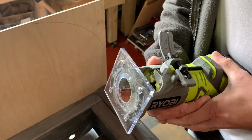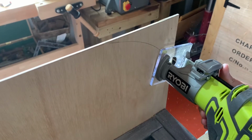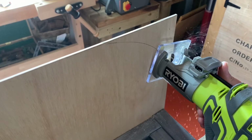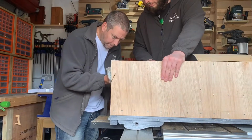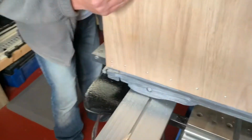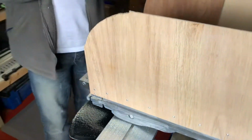So let's get this routed out. Okay, so what we've done, we've routed that out. Now, it is a wee bit rough and I've kept above the line. That will allow me to swap the battery into the Ryobi sander, non-sponsored, and we'll sand off this area and smooth it, because you can see there's a high lip here and a high lip here, so we want that nice curve to form. So, let's get sanding.